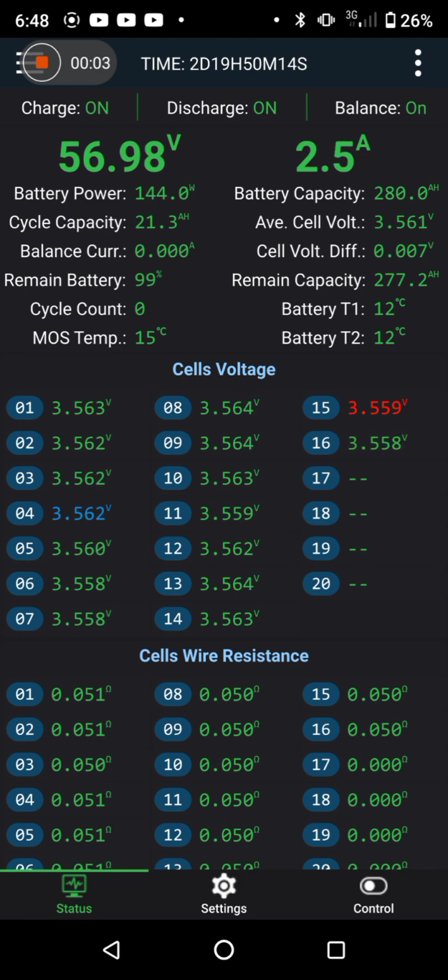I definitely seem to hit a glass ceiling at the absorption phase with this inverter. It's different to the grey inverter that I had, the cheap Chinese generic grey inverter. That would go right up to bulk voltage and then go into absorption, whereas this seems to hit a glass ceiling and take for absolutely ever.